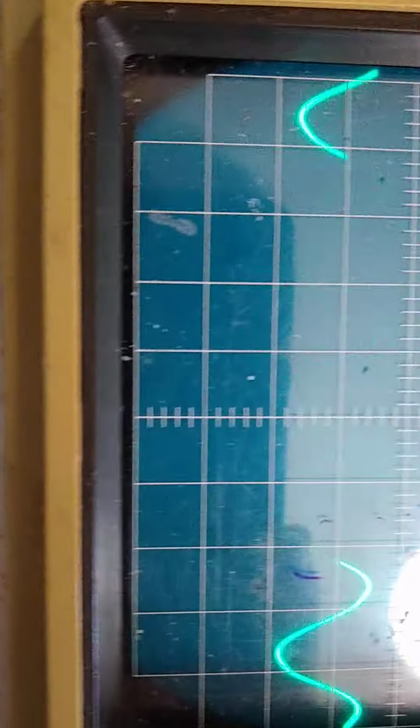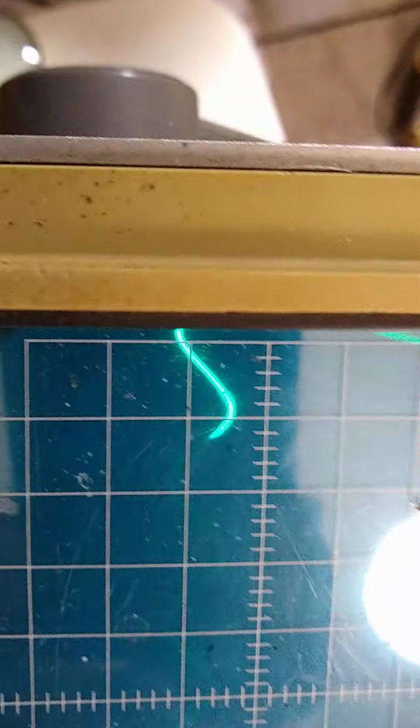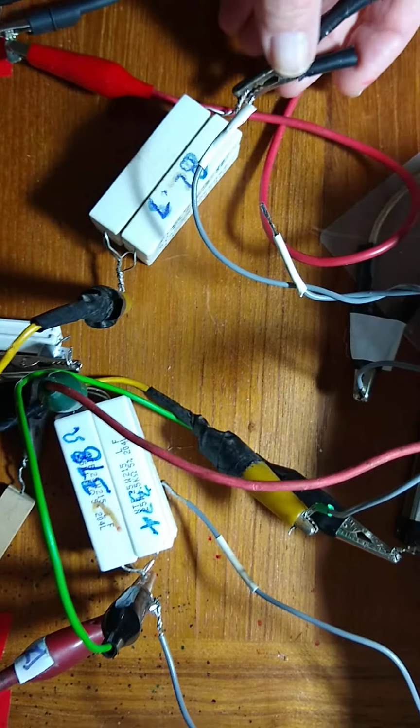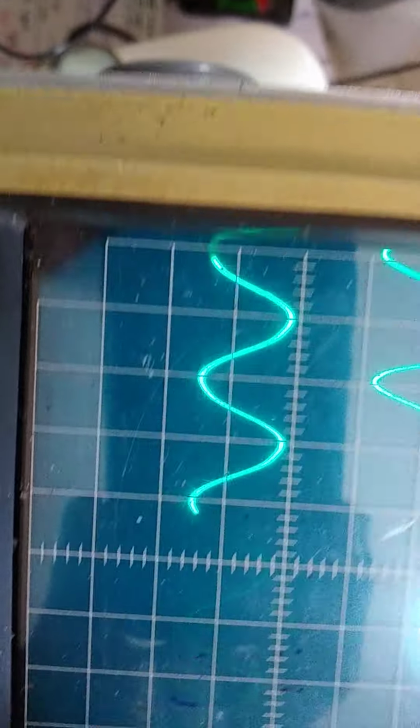And I remember it lurching up. It was like this. And then it lurched up and I jiggled this wire up here and it went down to here. So I thought it was a poor connection, and that lines up with what the meter says, if I have an amp meter coming out from the variac to the primary. Because it lined up with the amp meter, I thought, okay, that must be okay. But I think there was something going on. One of these not hooked up. That's all I could figure out, why it was so low of amps input.